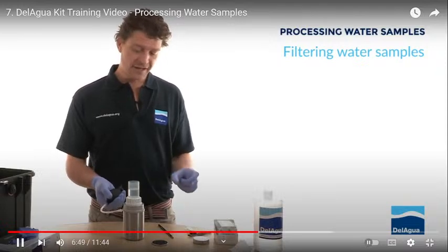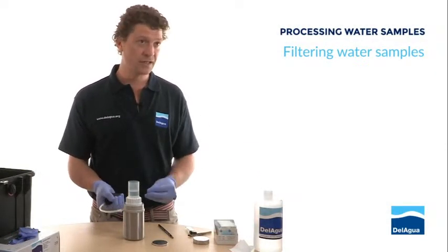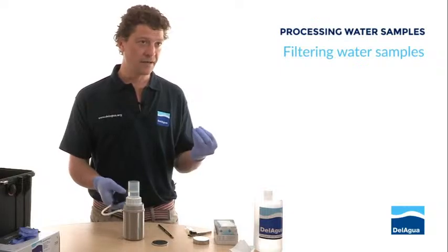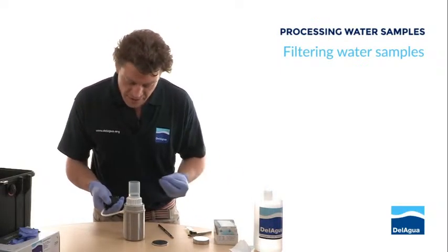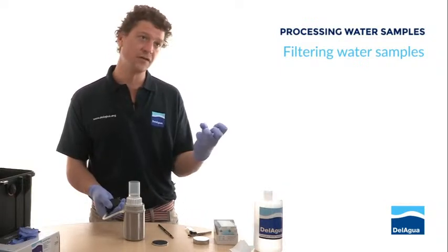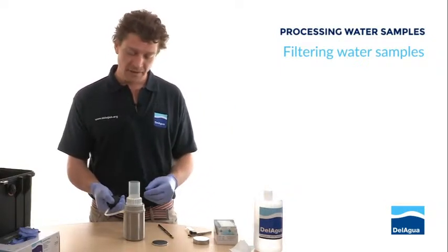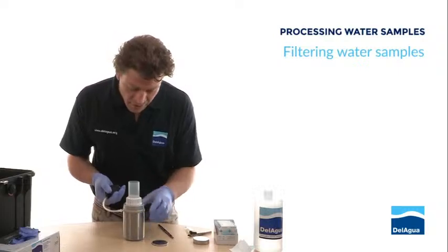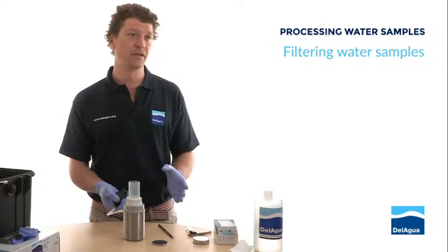The turbidity of the water, which we previously analyzed, will have an impact on it. However, if you go too fast, there are certain likelihoods where you'll cause the filter to either rumple or crease, and then sometimes you can end up with mild compromises of the filter, in which case you'd need to run that process again.